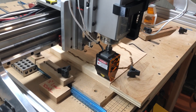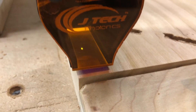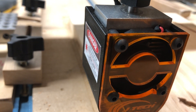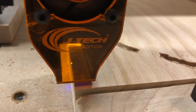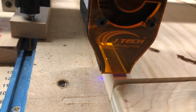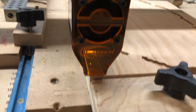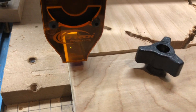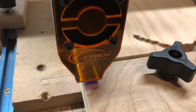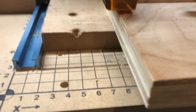I'm going to zero in the laser. Let's turn it on and move it - you can see it in there. We're going to zero this out and make sure I use very small increments so I don't ruin the piece. Once it falls off the edge, there's X, and then we do the same thing going the other way. Small increments, very small - and that's the X and Y right there. There's Y, and we can return to zero.